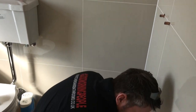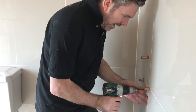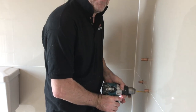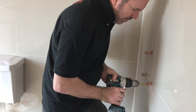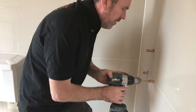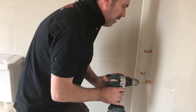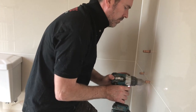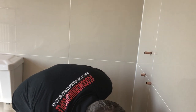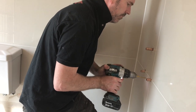And then we'll get a drill bit. Kitchen and bathroom, these are the best tile bits you'll ever get, in my opinion. Okay, porcelain tile. Keep it wet. Oh, it's like a dream. I can't show you any easier than that. Keep it wet.